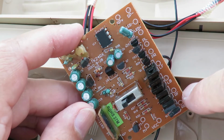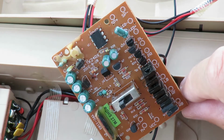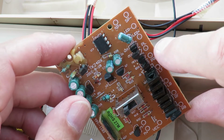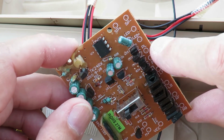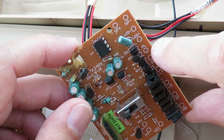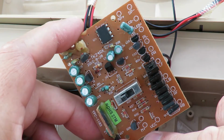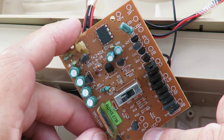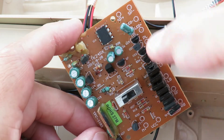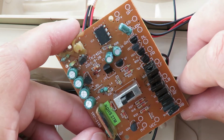Left motor, right motor, that's fairly easy to replicate, just an ESC to drive each motor, brushed ESC. The turret would be fairly straightforward as well, just left and right. And then the muzzle, plus and minus. 1 channel, 2 channel, 3 channel. You should be able to do it with 4 channels, shouldn't you?